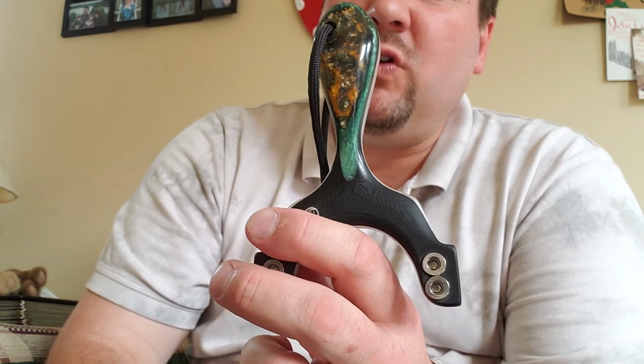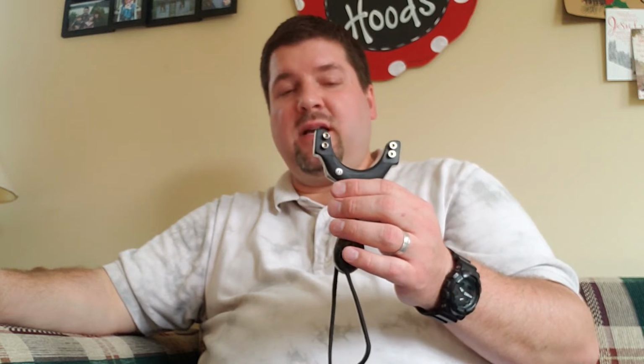Okay, voodoo resin. Kudos to Martin for letting me know that you didn't have to do much with these clips except just hold them together tight. I was worried that we might have to put a groove down it of some sort and a round rod on the other side so that it would press it down into the groove. But he said no, as long as you cranked them and you had metal on both sides and you could crank them tight, that's all you needed. And an 1/8 inch was plenty strong enough to hold them in place. I tried, and sure enough, once I built this, I tried several thicknesses. They all worked great. Never pulled out.